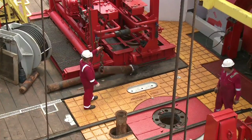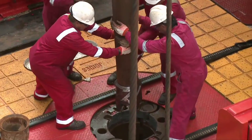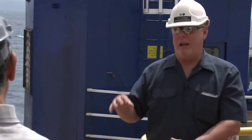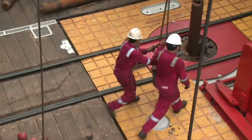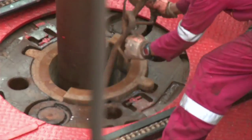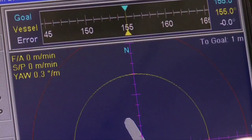Before we start drilling, we have to have what's called a bottom hole assembly. That is the drill collars, the outer core barrel equipment, and the bit — everything used on the end of the drill pipe that actually cuts the core and allows us to land our core barrels and recover the cores with our wireline coring system. All the weight of your drill string is associated with your bottom hole assembly. It's like a pendulum — a string with a heavy nut on it. As long as you don't put any more weight than the BHA weighs, it's only going to go straight. Gravity does all the work.